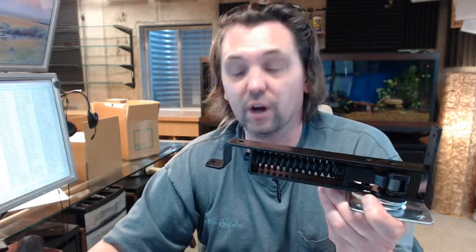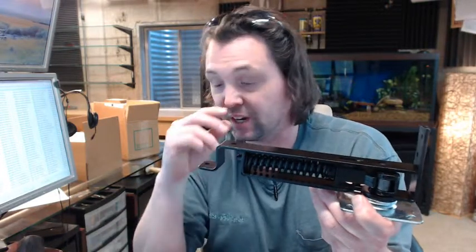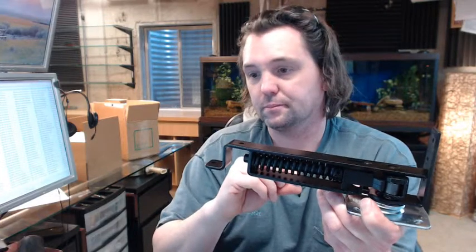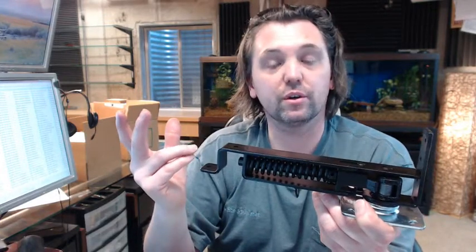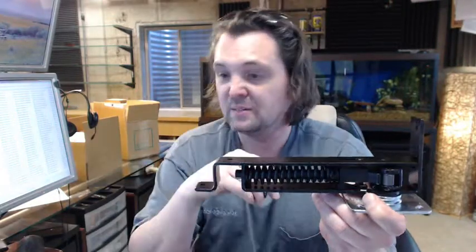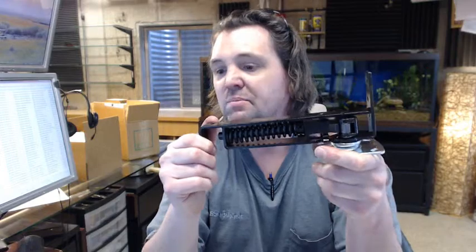I want to mention 9/16 of an inch undercut is what this is all being based on, and then 1/8 of an inch at the top of the door. So the door height, let's say 80 inch, allow 1/8 at the top, 9/16 at the bottom. Okay, so 11/16. So you're going to be at 79 and 5/16 would be a net door height for that. Keep that in mind. That's important. That's coming off the template. That's the one thing that's really not noted on the instructions that I've noticed.